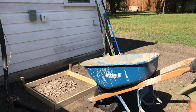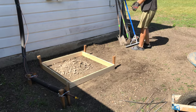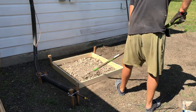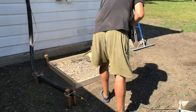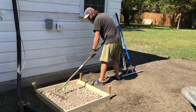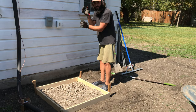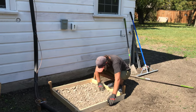I'm going to pour the concrete on top of the rock. I think I'll spread that out first and then see if I need more. Might be enough because this is small. Then I'll level this out real good. Then I'm going to mix the concrete with water and pour it in. Then I'm going to smash all this down with my compactor to make it flat.